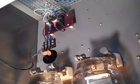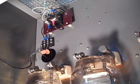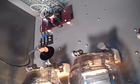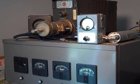Located up inside the transmitter is the TR switch — that switches the antenna to and from the transmitter between receive and transmit. We'll go ahead and switch it to transmit right now with the plate off; you can hear the relay working. The 1500 watt dummy load is very useful for doing all the tests on the transmitter before putting it on the air. This dummy load also has a sample port useful for feeding a spectrum analyzer for checking for harmonics and spurious. There's also a small 500 watt bidirectional power meter, which is currently reading about 425 watts.